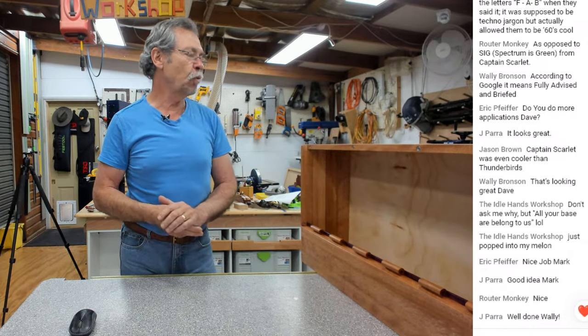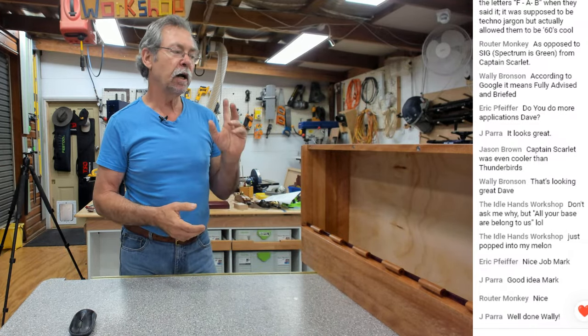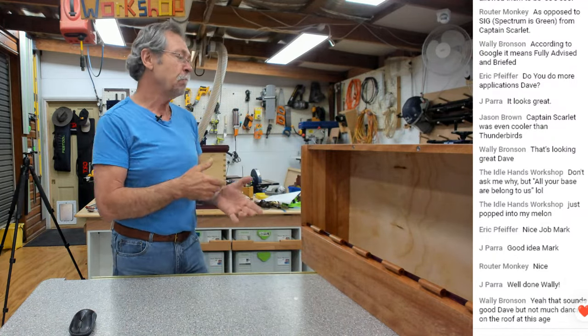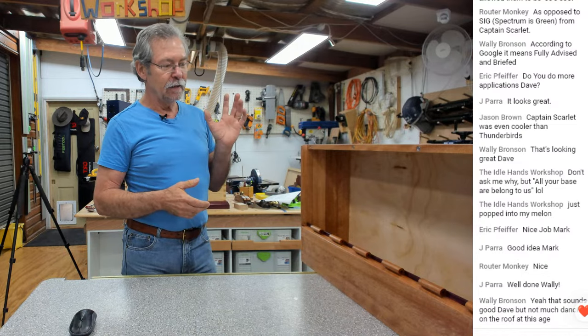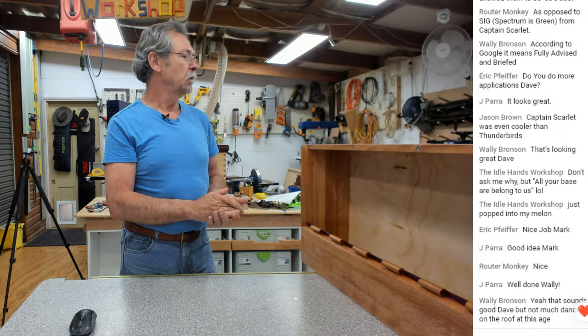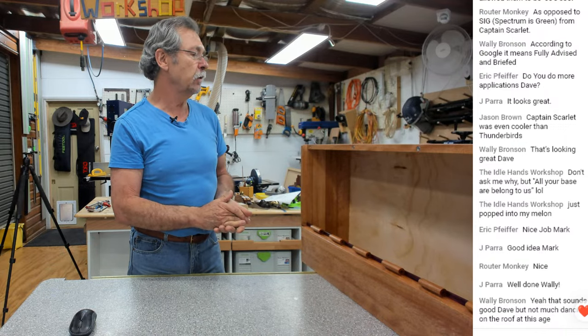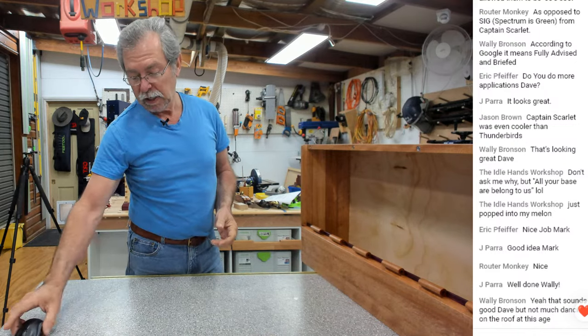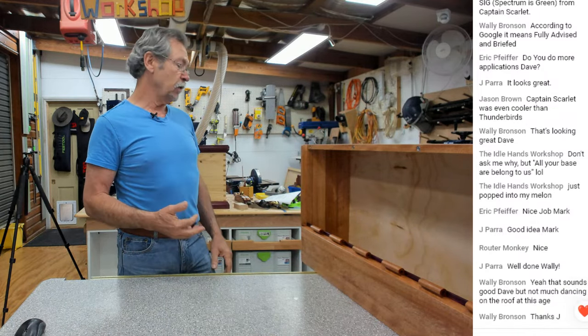So to keep it stable and to keep it nice to touch, after the first coat, you let it dry, maybe a day, then give it a very light sand with some fine sandpaper. They recommend 150 or finer. I've taken this job down to 2000 because that's just me. I'll probably hit it with some 500 or 800 and then put the second coat on. I might even do that tomorrow afternoon. And then it's just about ready for me to move on to the next stage.